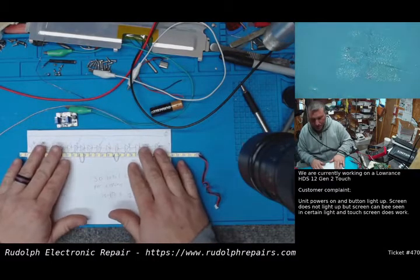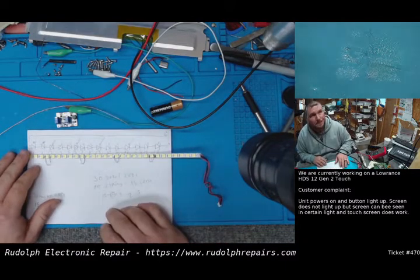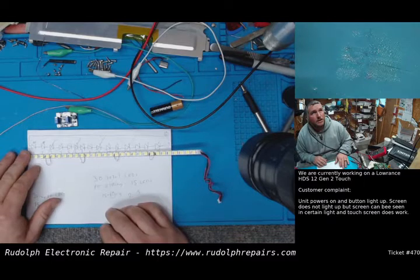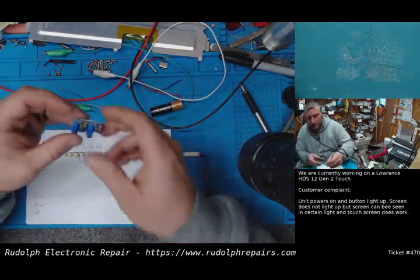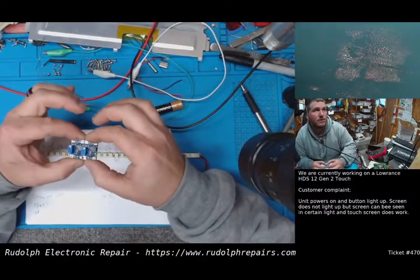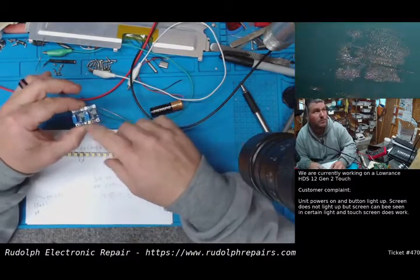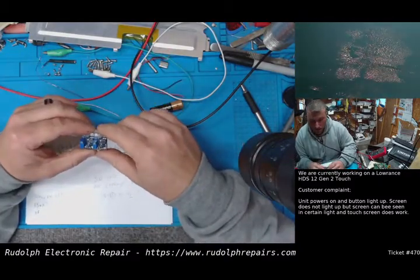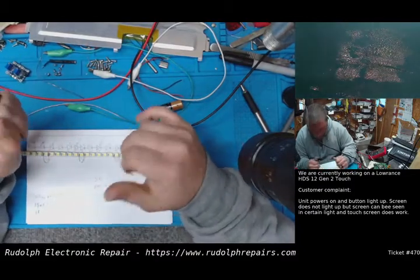Okay, let's do the same thing for the second strip, the second circuit in here. We're going to short four LEDs. And once we short those four LEDs, we'll give it a test. And then what we can do is we can just use one boost converter and we'll just go in parallel. We'll come off 30 volts, go to one strip, 30 volts the other strip, and we should be good to go. We should be good, guys, here. So let's give it a shot.